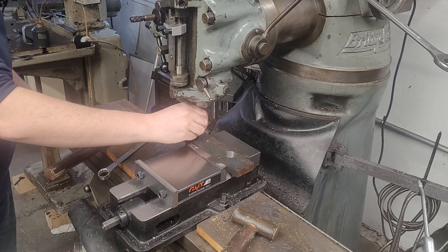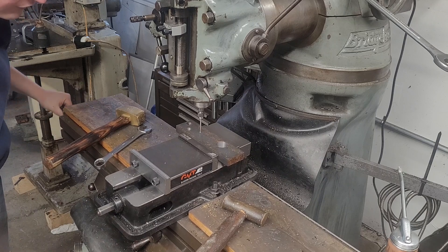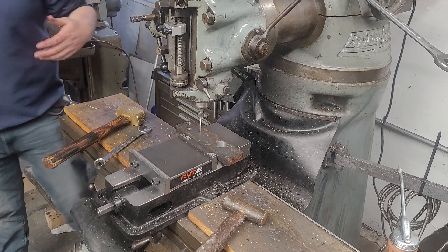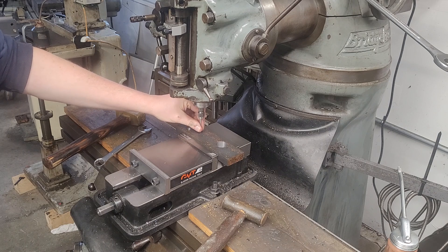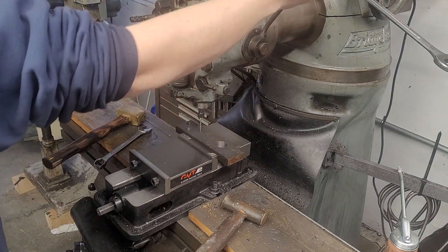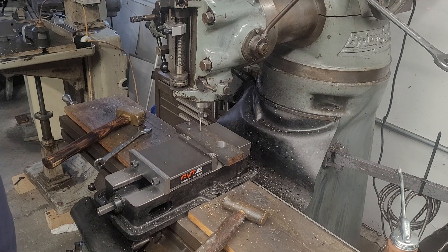Another video we could probably cover is discussions on VFDs and their advantages and disadvantages. I really enjoy VFDs — they have a lot of utility for a shop like mine, but they also have a lot of disadvantages. So we're just going to start the machine, and basically once this guy's running true, I kind of just stick it down into the very bottom of the center punch and see if it deflects. You can also do this without the machine running, but it is a little bit easier with the machine running.